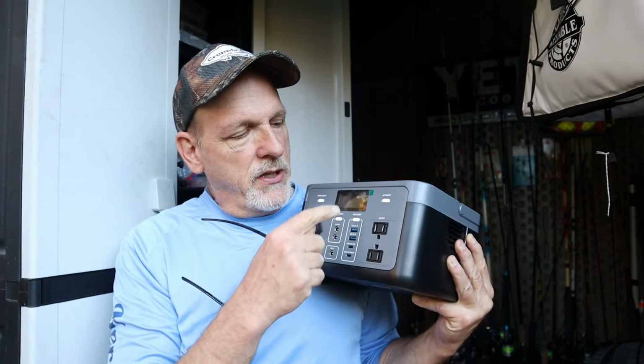Okay, as you can see, that Radioddity CB 900 Pro, I did a video on that recently. That's a really good radio for the money. I'll put a link to that in the description. It puts out 9 or 10 watts dead keying, swings up to 14 or 15 watts. It's drawing 3 watts receive, if you saw on the video I just showed. And when you transmit, it's drawing about 25 watts, if I remember right.